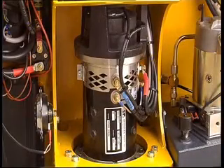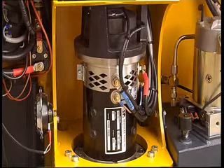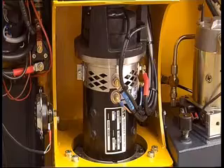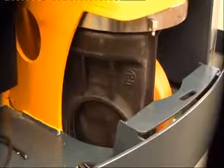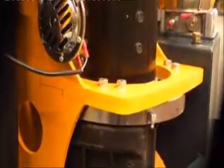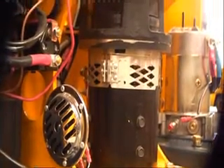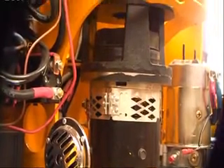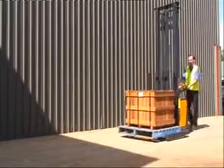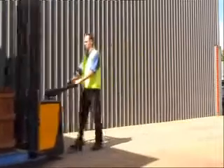Advanced Sepex 24 volt DC drive motor with sealed bearings, heavy duty commutator and stainless steel brush holders provide a powerful traction control system. Drivetrain is via the latest SuperQuiet ZF direct drive transmission that is oiled for life and comes with the manufacturer's 3-year warranty. This combined with the Sepex motor and Sepex control system provides smooth acceleration and energy saving dynamic braking.